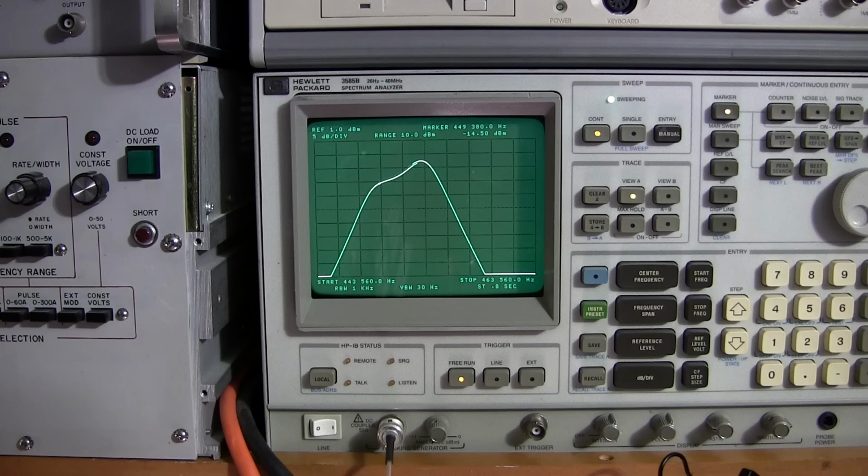You can see that we're losing amplitude again. You can see how that's kind of shaping it a bit. So I'll leave that one right about there. I'll move over to the next one towards the face. You can see very, very slight adjustment of this one really affects this. That was about a quarter turn. Now I'll move to the upper slug. You can see I'm also shifting the frequency here, how it's moving that peak over.